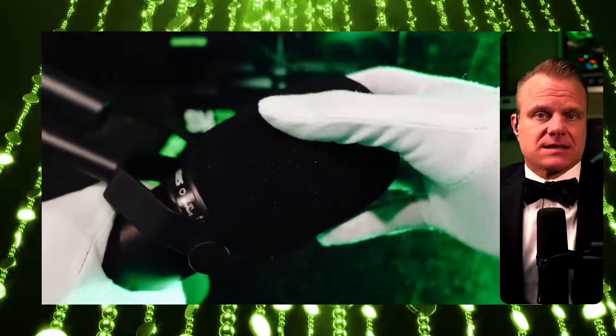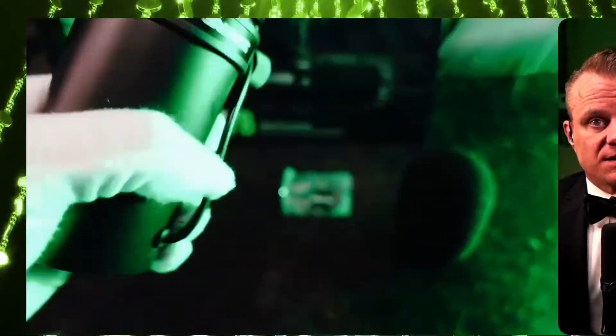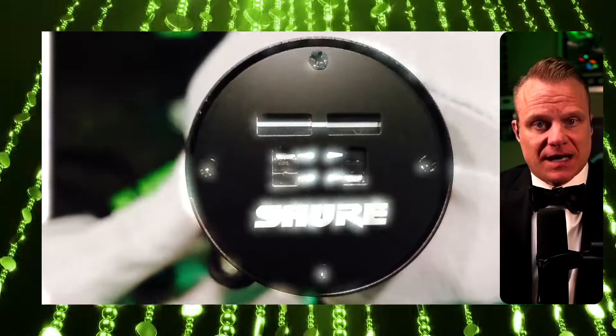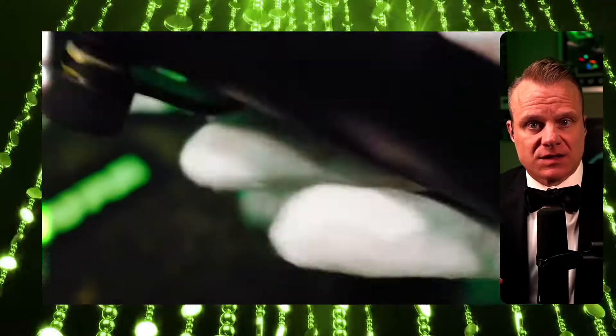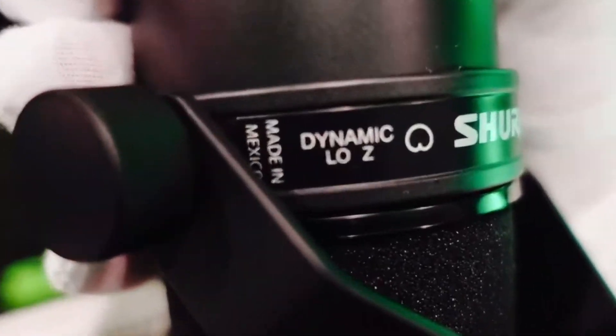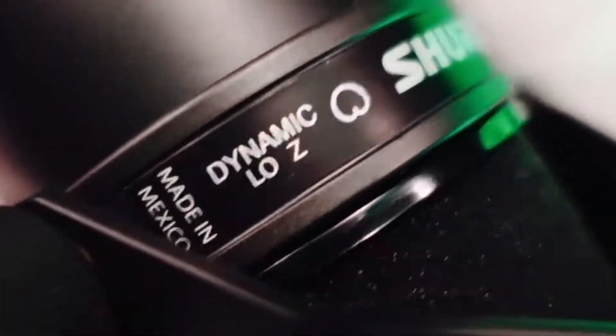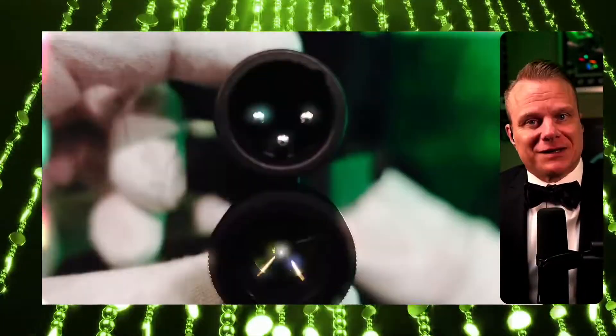It is what we consider a gain-hungry microphone, so you really will need at least 60 decibels of gain. That's what's recommended to get this iconic warm and balanced tone that you're hearing right now, most commonly associated with this SM7B. Once you have this microphone, you can shield your sound — there's advanced electromagnetic shielding that defends against hum from computer monitors and other studio equipment, and it's got all that stuff built in.